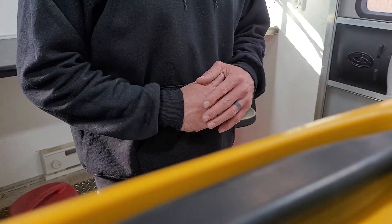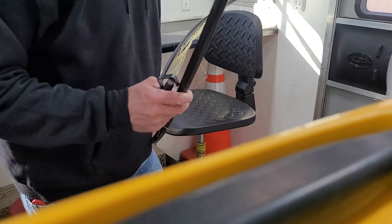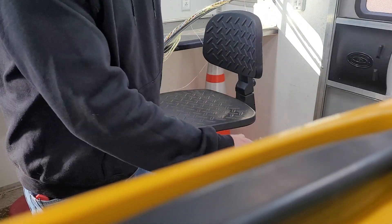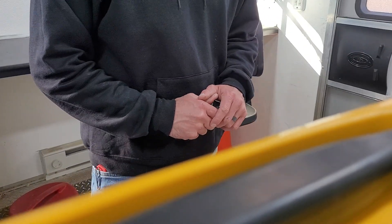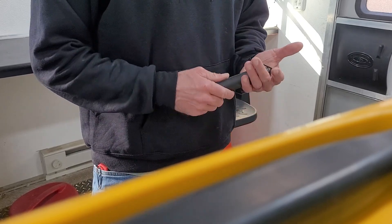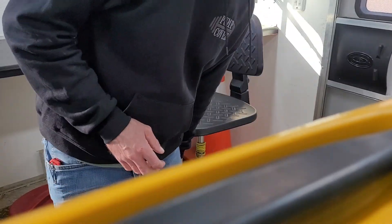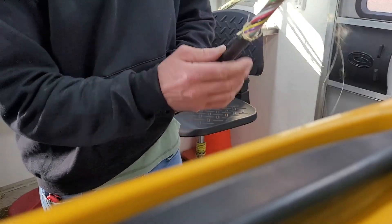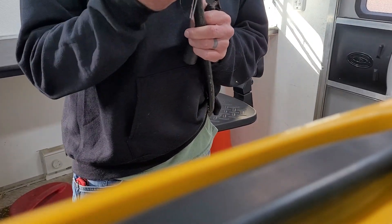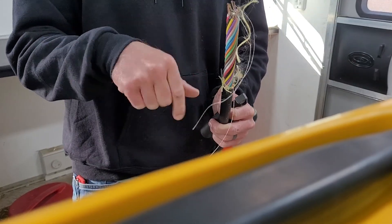It could be a lot of trouble for you as a business or contractor if you were to take down those fibers. In this example, I said 144-count — there are 144 fibers in here. There are cables with thousands of fibers in them, so this is nothing in comparison. You peel that off successfully and you've got to make sure your ring cut tool's depth is set right or you're going to cut into these tubes as you go through the jacket.